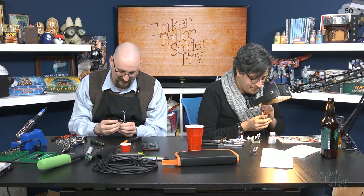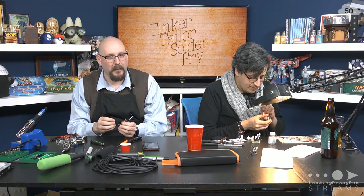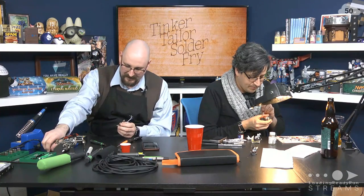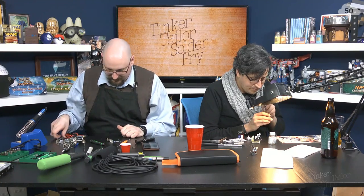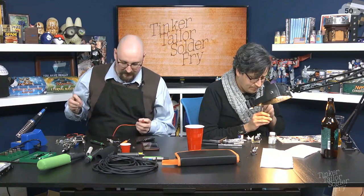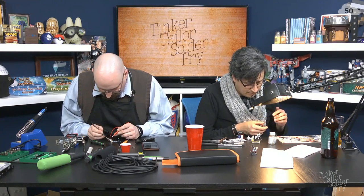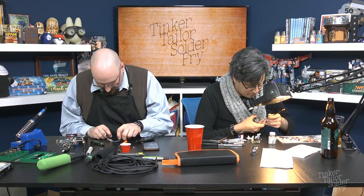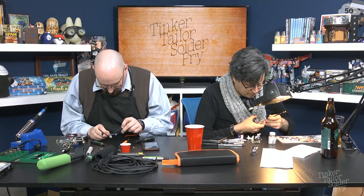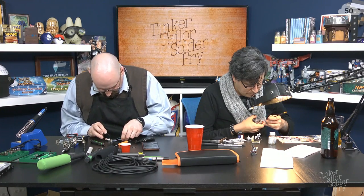So I wonder if, like... I think someone screwed it in thinking, oh, this will fix the problem. Mm. And thereby created a second problem. I see. Let's again check continuity here just to make sure everything's all good. Okay, ground is good. Green pin. Seems good. I mean, there's no actual problem with the soldering joints, it looks like.